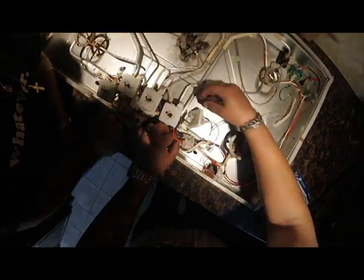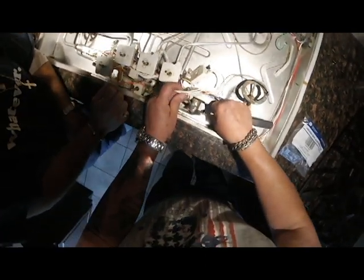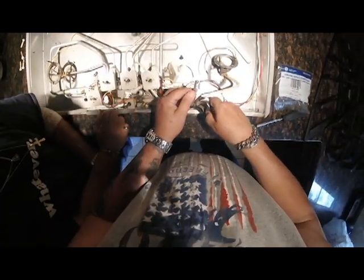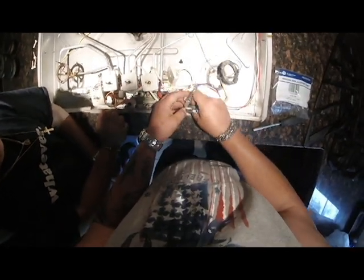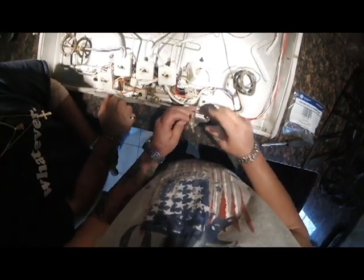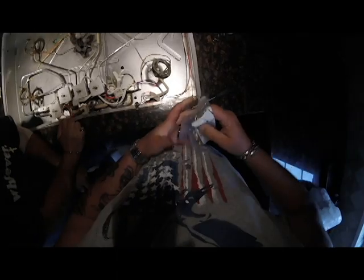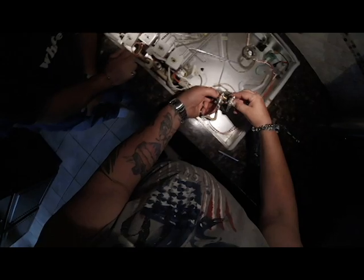All right, this bolt comes out, then your valve removes right out of there. You gotta get an adjustable wrench, disconnect that line. Counterclockwise thread, standard kind of thread, not opposite, like gas is a lot of times. If you see here, there's a rubber seal on the back of the valve that seals it up to the manifold as you tighten it with that retaining bolt. That looks better, right? Yeah.